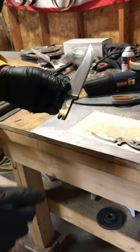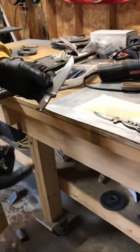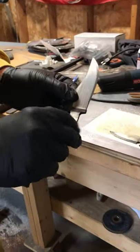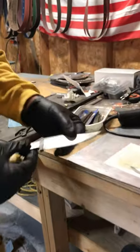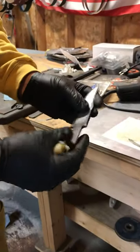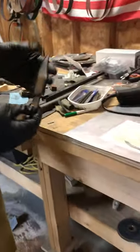This will get some all-thread connected or welded on there, and then we'll have a nut connected to our pommel. This will be a through-tang knife or a takedown knife — it won't require any epoxy in the handle, it'll just be all mechanically fastened. We've got to make a guard for that, and this will get some handles today, and I'll be moving on with this one.